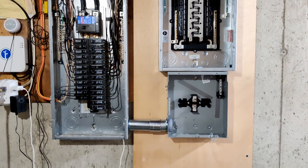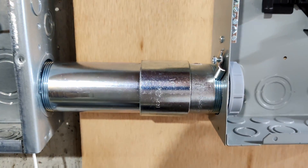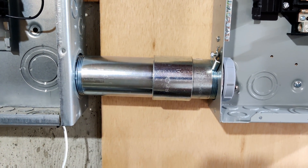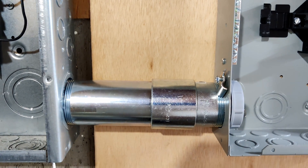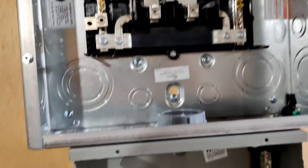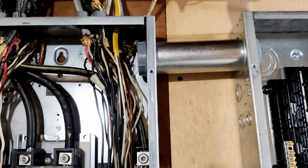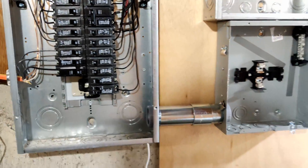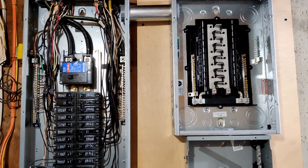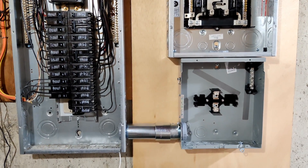It went up to two inch here — I figured it may as well, so I should have plenty of capacity for wires between all these different boxes. I completed mounting the boxes on the conduit finally. I didn't manage to get the top one quite level — it's irritating my OCD a bit but I will have to deal with it. I did have to use a coupler because I couldn't get a length of rigid conduit the appropriate length for this connection, but it looks fine. All the bushings are in and all the lock rings are tight. The next step is going to be actually doing wiring — that will be in another video. Thanks for watching, and don't zap your dingus.